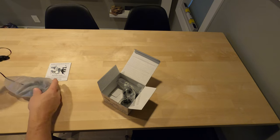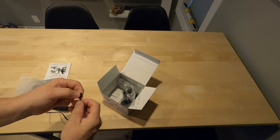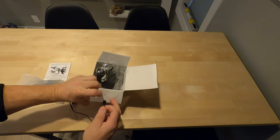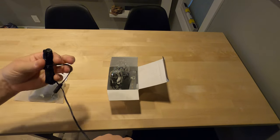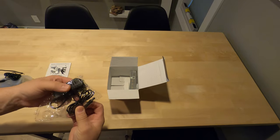So if you ask what an IR emitter is, if you've got the face of a front of equipment, a lot of the gear actually used to have a little IR logo. A lot of it doesn't now, but you'll see a circle. You can take a flashlight and shine it in. But just imagine this is the face of a piece of equipment. You would stick that on there, and then this is going to run over to the connecting block. I'll show you that in a minute. And so power supply, generally these are going to all be 12 volt.